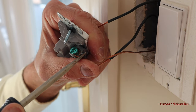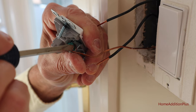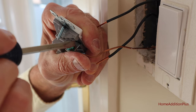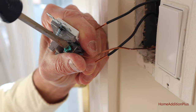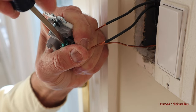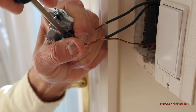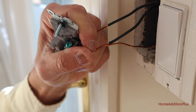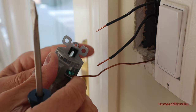I've attached the copper ground wire to the green nut. I've got the rotation of the loop on the copper ground wire going clockwise, the same direction as the nut. That way I'll be sure to have a nice tight connection that won't cause the ground wire to unravel as I tighten up the screw. And there it is. Next part's even easier.